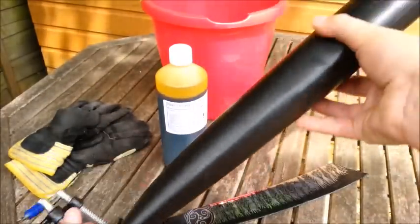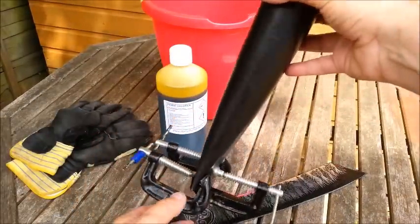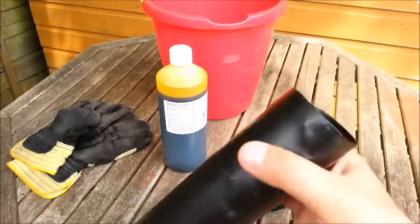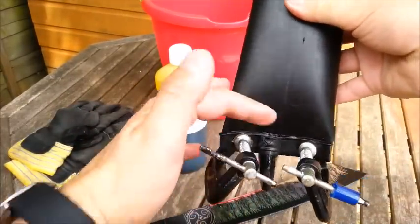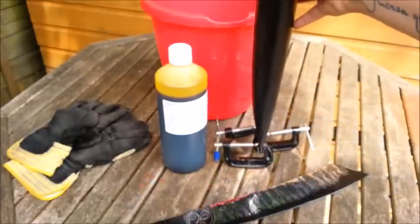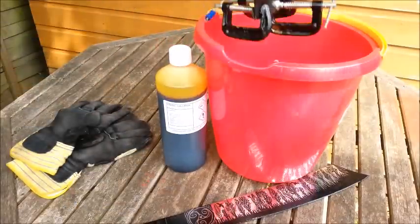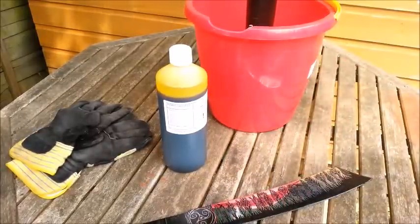For my bath I want to dip it in rather than lay it in, so each side of the metal is exposed to the acid. I've used a plastic pipe, obviously because it's caustic to ferrous metals — you have to use plastic or glass. I've used a piece of plastic tubing, folded it over, and melted it just to seal that end, then folded it again and clamped it just to stop it leaking. Using the G-clamps it actually makes a stand. In case that fails I'm putting it in a plastic bucket to contain any leakage.